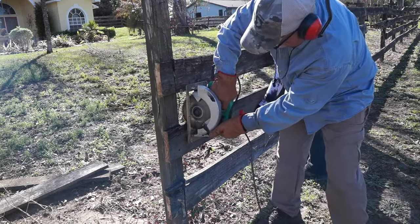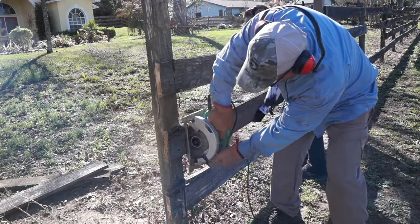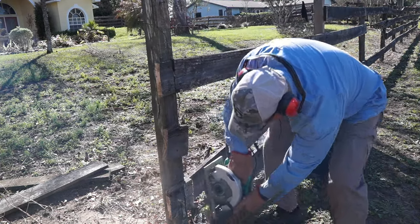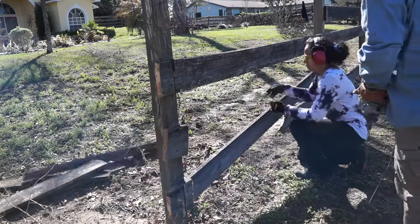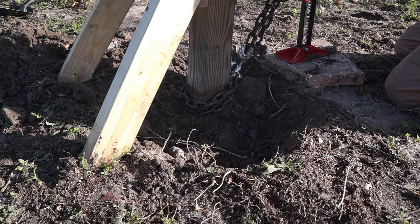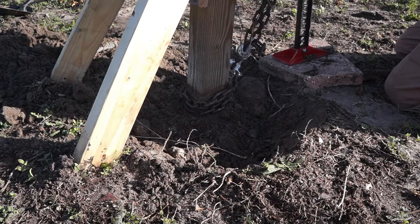But it is a two-person process because you do need one person to hold the slat in place to keep your blade from binding on you as you cut through the wood slat. Now that all the wood slats are removed, we can start tackling the fence post,